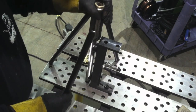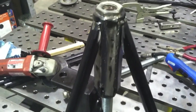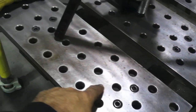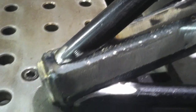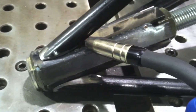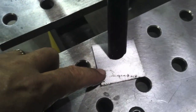When you're doing something with round pieces or a three-legged structure with angles, it can throw you a curve if you don't have the right tooling — you end up tacking stuff together, taking it back apart, and whatnot. I've got this thing all like I want it, all three legs touching with everything plumb. Now it's time to weld these out. I've got a lot more tacks on them so they won't move. I'm using about 18 volts and 250 inches per minute of wire feed speed with 0.030 wire diameter, using a little overlapping E-type technique.